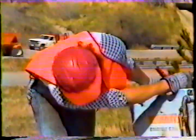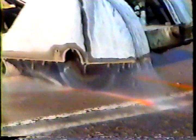When you mark the area, be sure to use a straight edge so the saw cuts will be as straight as possible, and mark at least 2 inches beyond the extent of the damage. This is important because it's difficult to see exactly where the saw is cutting. You need a mark to follow beyond the point where the saw cuts intersect. Remember, the cuts have to cross each other completely, so the corners of the repair will be the right depth.